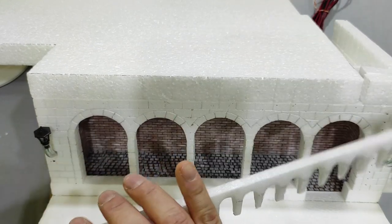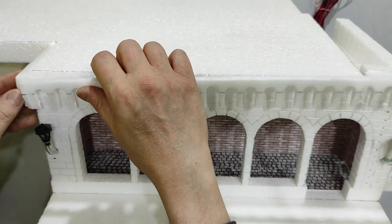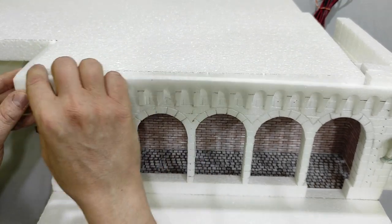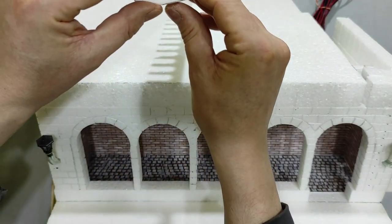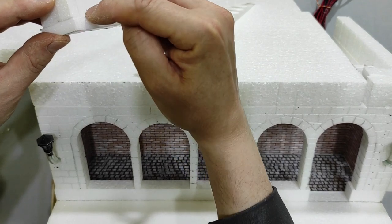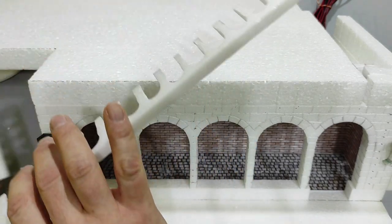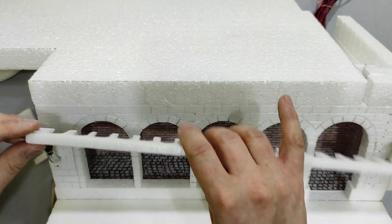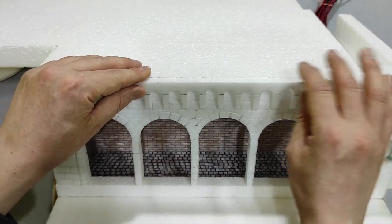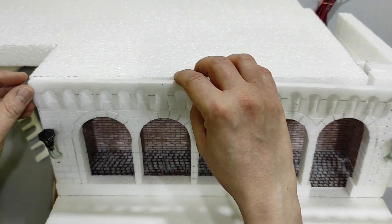The difficulties there will be here because I still need to cut them in order to go precisely once against the other. I don't want to go like this with the junction here visible from this side. I will need this time to cut 45 degrees there and 45 outside, inside, and then I will place them together in order to have a perfectly angled corner. This will be a little difficult right now, but I need to place them and to glue them together right here. So I will go with some glue here on those 2 centimeters there and no more because I still want this to be removable.